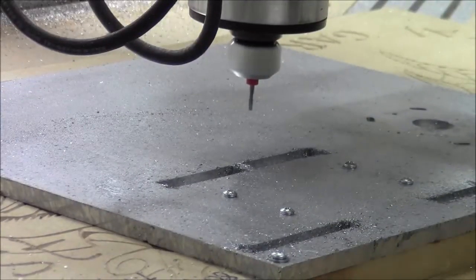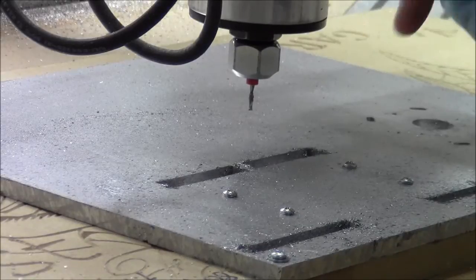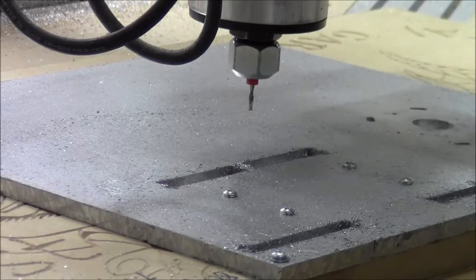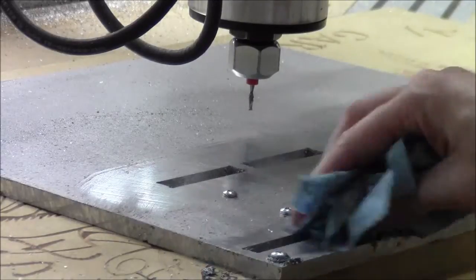That is the rabbets, and there was some pretty good footage on that. There were a few places where the cutter was getting a little bit clogged, something was jamming up. I think it was probably the aluminum shavings getting stuck to the cutter, and a quick little jolt of WD-40 took care of it. So I'm very encouraged by what I'm getting here.